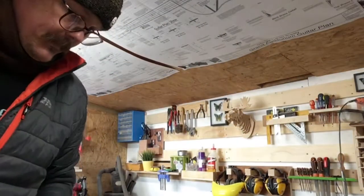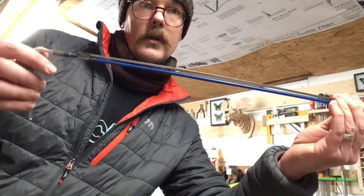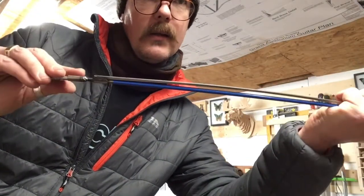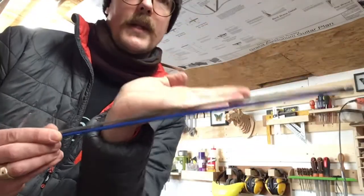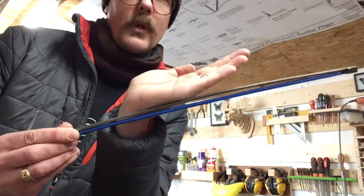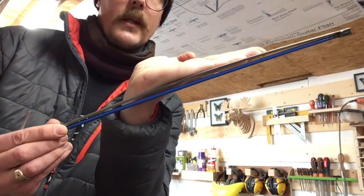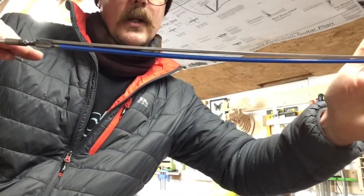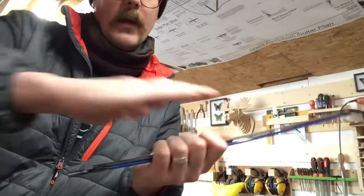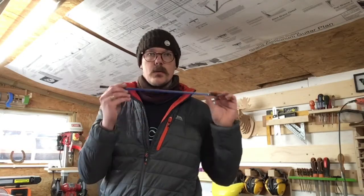So always test it, just in case whoever put it together did a shoddy job. But basically, turn it one way, you can see now, we're getting a nice flex in that top bar. Obviously the neck's going to want to do that when you put some string pressure on, so the way I've just done it there would help you straighten that out or even give you a little bit of back bow. There we go, you can see it's bending the other way now, and that would help you bend the neck forwards. So anyway, that's what we're doing today. We're fitting the truss rod.